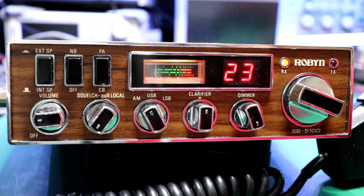On single sideband, this radio will RMS about eight to ten watts and I'll get about twelve-plus watts PEP. I'm totally happy with that. Audio on here is great — it's nice and clean, 100% modulation on both AM and single sideband. Just a great waveform to it.